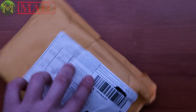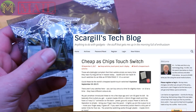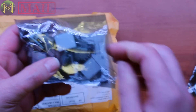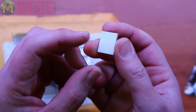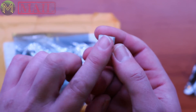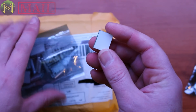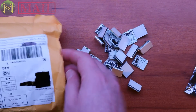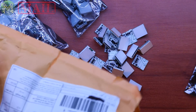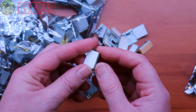So the next one — I don't know where this came from, let's find out. You would have seen in weekly roundup number 40 — Peter Scargill found these very small touch sensors. The really good thing about these is they're only about a dollar US each. You provide 3.3 volts and it's a very tiny capacitive touch — it's got a little LED on it, and it's a simple on/off toggle. If you want to have a whole lot of buttons, it's actually the cheapest thing to have — just multipurpose, you can put them anywhere. The capacitive touch is so sensitive that it'll work through a case as well. So I bought a couple of these — I think there's about 130 all up. The reason being is I have a fairly good project coming up which will use 130 of these little capacitive touch sensors.